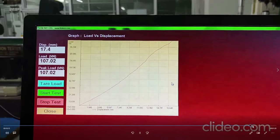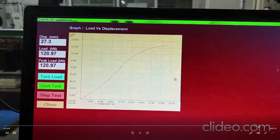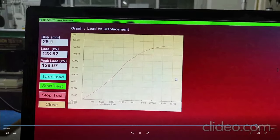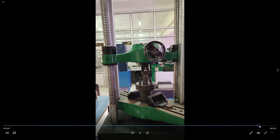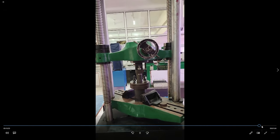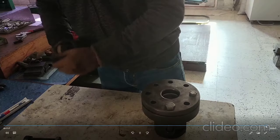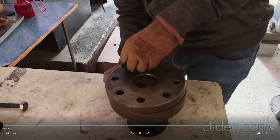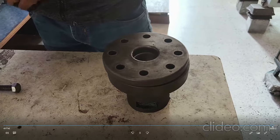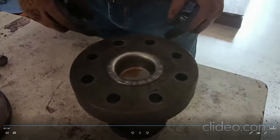You can see the slope is slightly changed and the load is almost saturating now, which means the cup is already formed because there is less material left to deform — the load is actually coming down. You have to stop the machine, stop the ram movement, take it out slowly, and disassemble the setup. This time a nice circular cup is formed which looks like an axisymmetric one — this is better than the previous one.